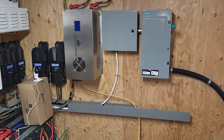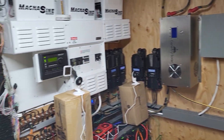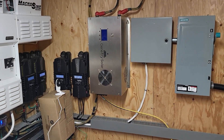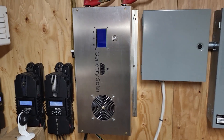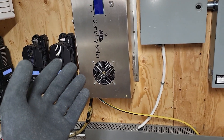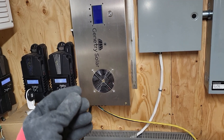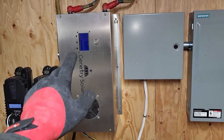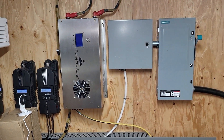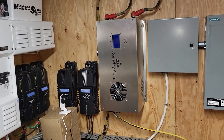One thing I forgot to mention: that transformer was outside the whole time — it was in a tent, so we knew enough to keep the rain and weather off it. But what I didn't take into account was the humidity. Once we hit 100% humidity after a couple of days — it rained for about three days — the transformer basically shorted from the humidity. It was so damp that the transformer started arcing on the inside, and I believe that is what killed the inverter. After letting that same transformer sit for about a month it now works again. But I cannot use it outside anymore — I won't put it into any more than about 60% humidity.